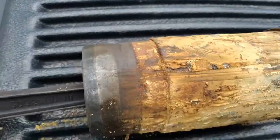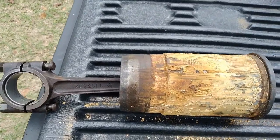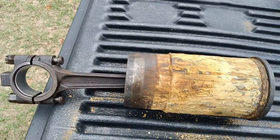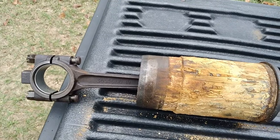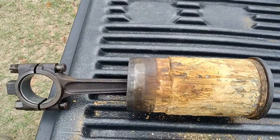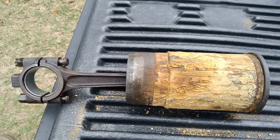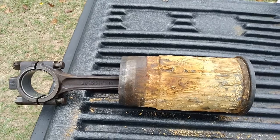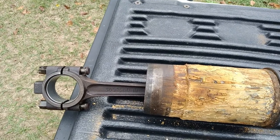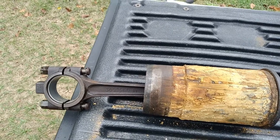We told him we're going to have to take the liners out. We tried heating it up, putting more Marvel Mystery Oil in there, diesel fuel, and all kinds of stuff, and nothing would budge. So we pulled the head off first to look at the cylinders - they were caked up pretty good, which is weird because the claim was it had been sitting inside a barn for at least the past 20 years and nobody ever turned it over.